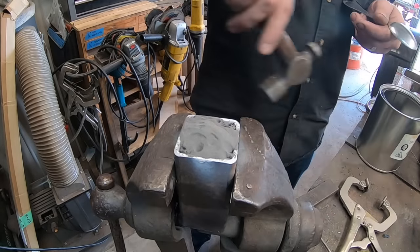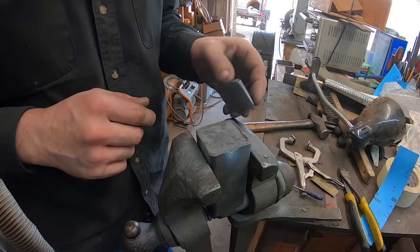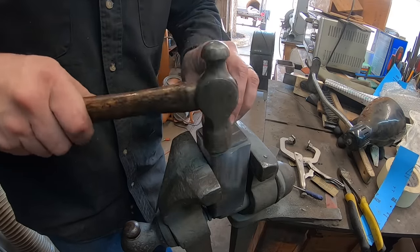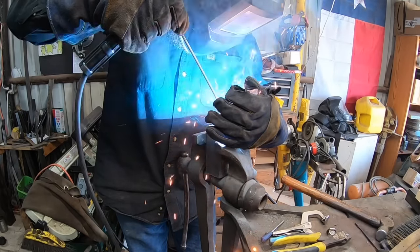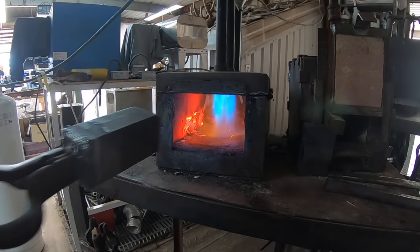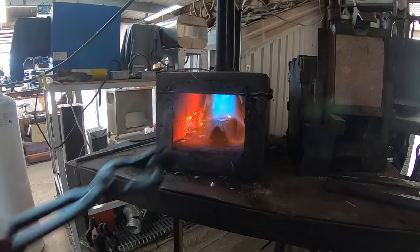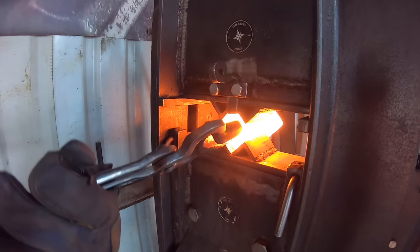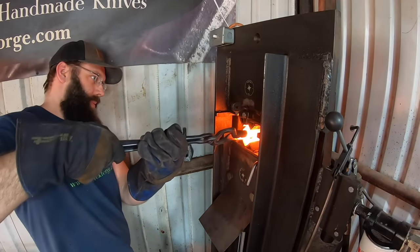The plan is to create a neat contrast between this high carbon 1084 powdered steel and these mild steel rods. We're going to incorporate this entire canister billet into a pretty cool knife. Got that all filled up with the voids knocked out, and we can weld up the top of this canister to make it almost airtight. Make sure there is a tiny pinhole in your welds — if not, make one with a small drill bit so your canister does not swell up and pop.